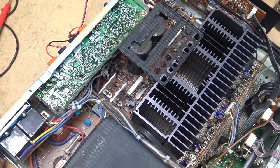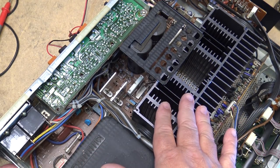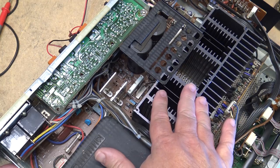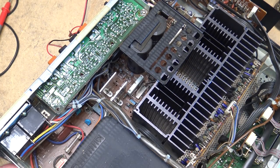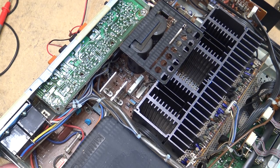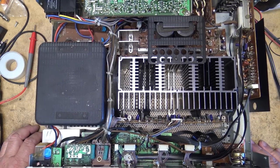Even though the amp is a push-pull amplifier, Technics call this a new Class A. What they do is they increase the bias to the transistor so the transistors are always in good conduction. Therefore, they'll never go out of conduction at lower power levels. When you increase the power levels, they drop the bias to increase the efficiency and give you the power of a Class AB amp.